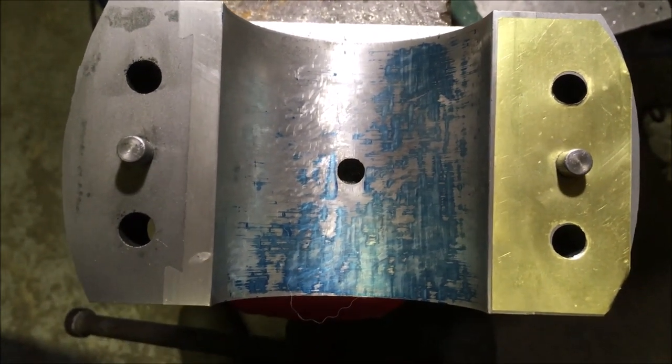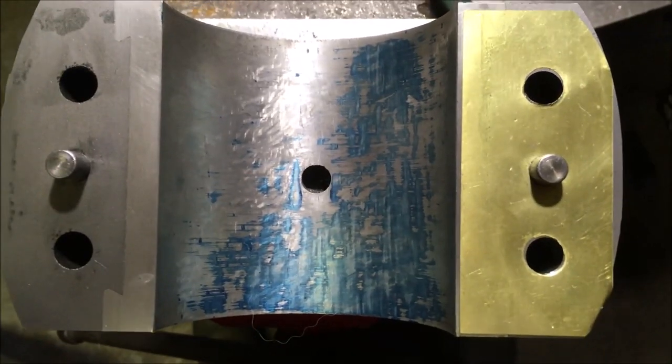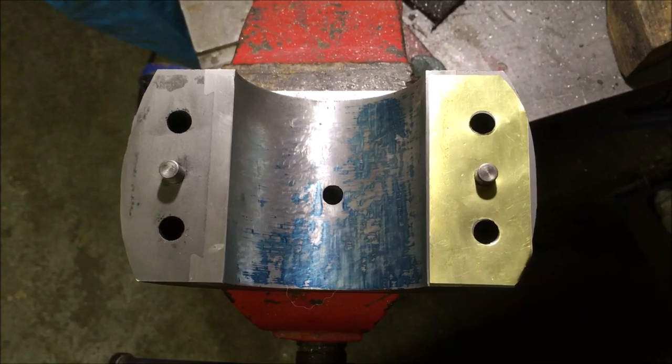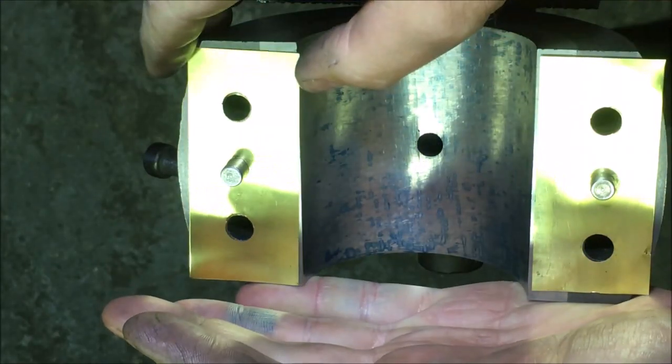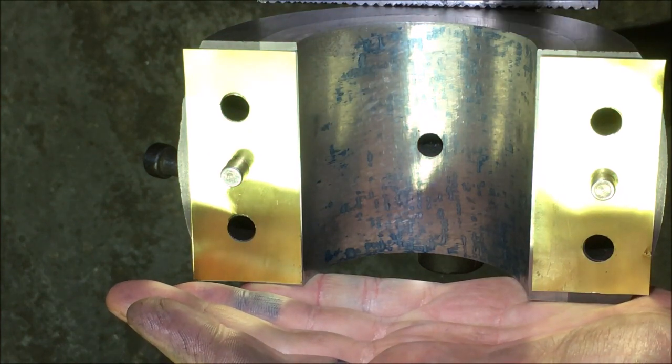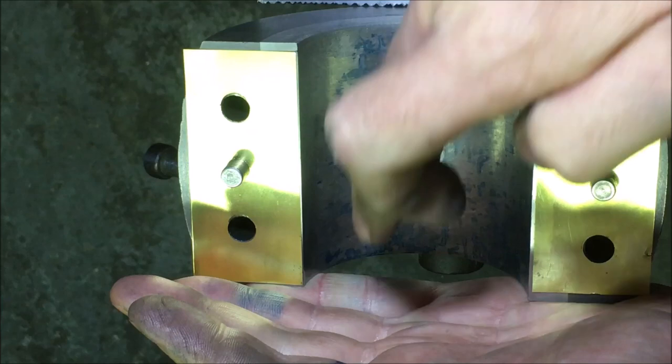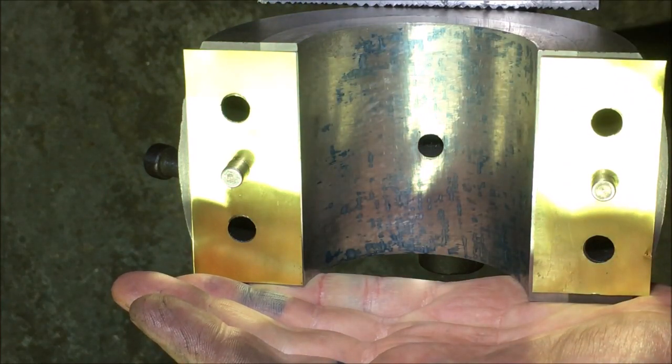God, it's obviously getting tedious. So yeah, it's coming together slowly. Finish it off tomorrow hopefully, then do the back. We're down to 2 thou thick shims now, and we started at 8. We're getting coverage. I mean, it's not great contact, but we're getting coverage now in the whole area, with the exception